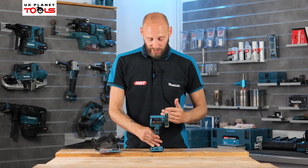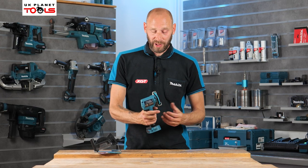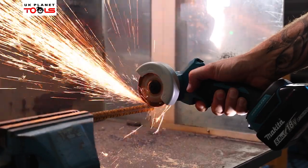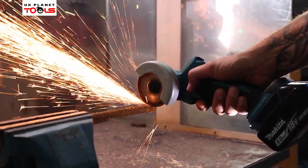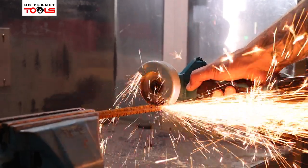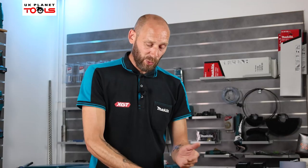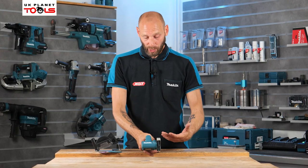The reason why we might want to use this machine in forwards and backwards is because it is a compact machine, so it is going to be used in nice tight spaces. If you are cutting any materials and the sparks are shooting out the front bouncing off the wall back to the user, we can switch it into reverse so the blade will go in the opposite direction and make the sparks come out the bottom of the machine rather than shooting out the top. It's more there for preference on which way you're going to cut the material or what sort of area you're in.